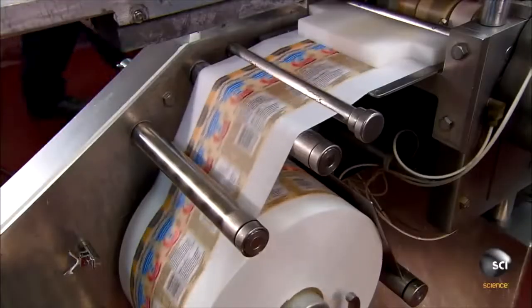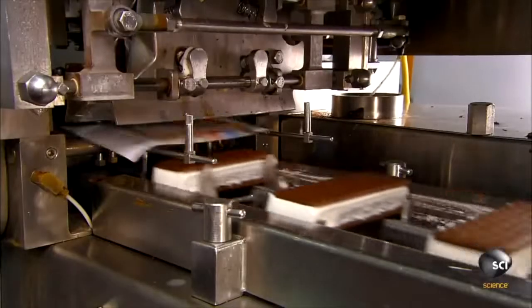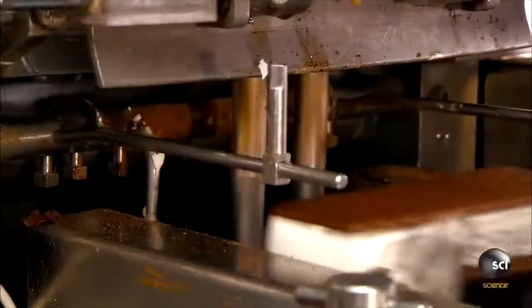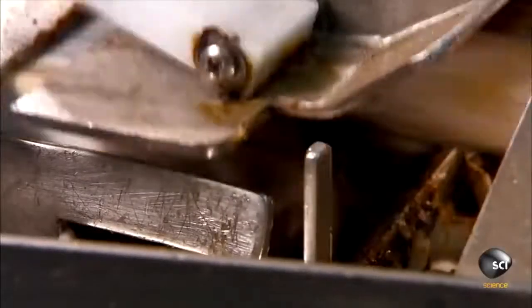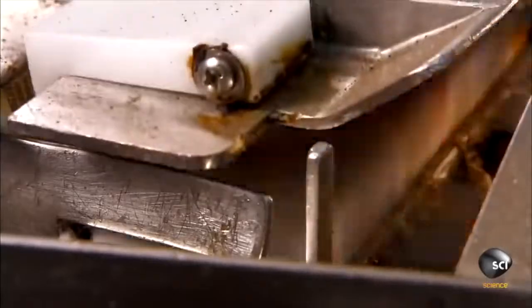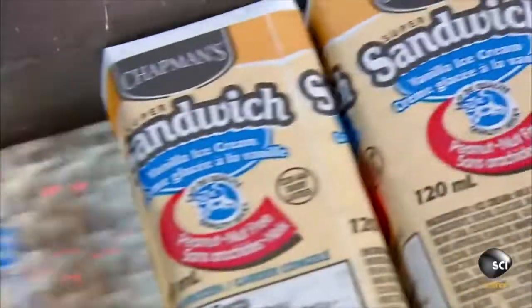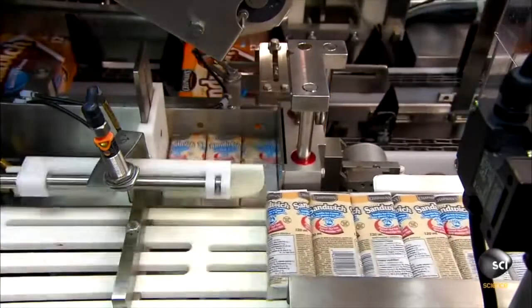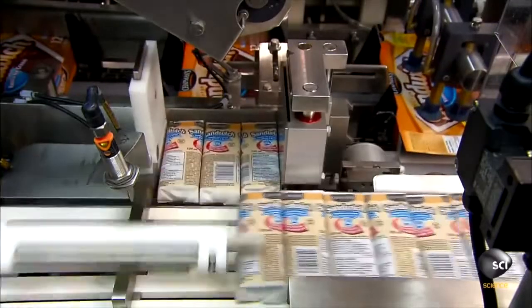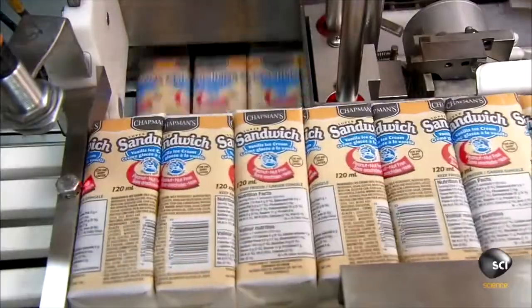As the sandwiches move on to packaging, the filling is still ice cold from the freezing phase, so there is no threat of meltdown. The packaging system raises each sandwich into a wrapper, then folds and tucks the ends. The next machine counts the sandwiches and inserts them into boxes. Once sealed, the boxes go directly into a storage freezer at -22 degrees.